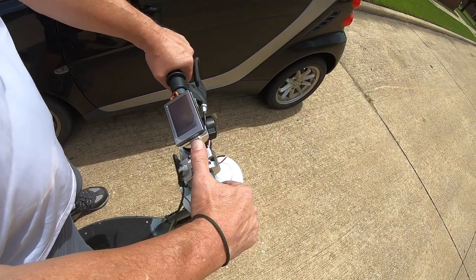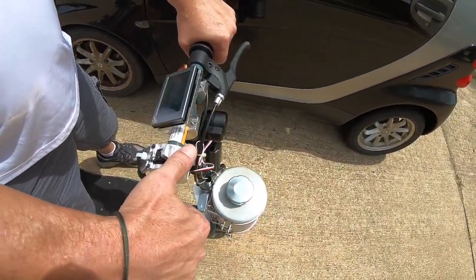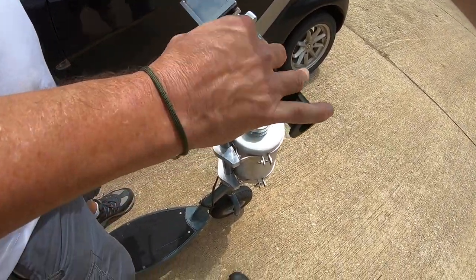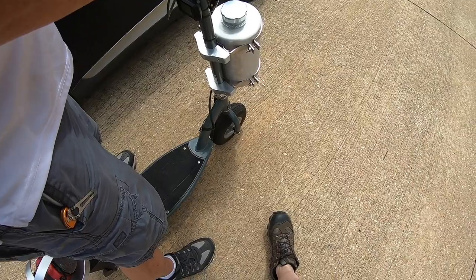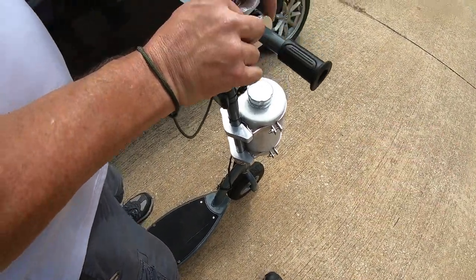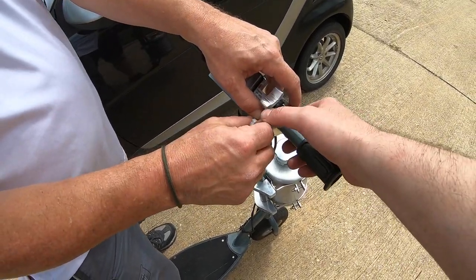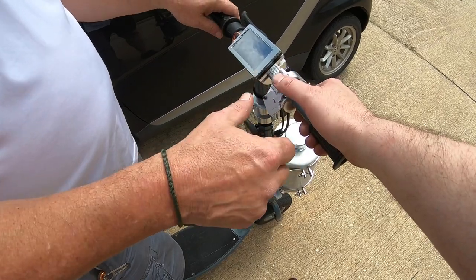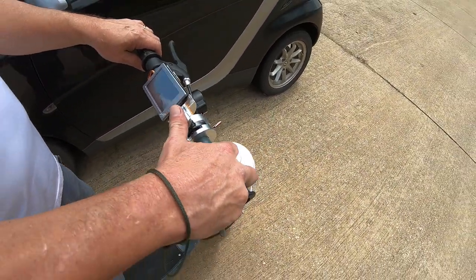There's a couple of switches. You get the transmitter on, a couple of switches down on the side of that case. And then it's going to start by putting the throttle forward and you bring that back to a certain spot. But the way we've got that set up with the automatic shutoff now, it goes back into idle mode. So in order to get it into the start sequence, it actually needs to come just a little bit below where that idle is.